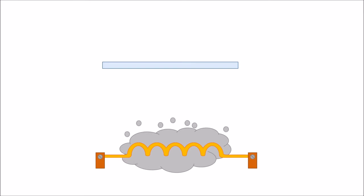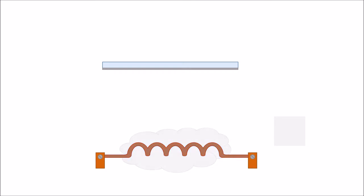The gaseous titanium atoms will make their way through the chamber until they land on a cooler surface, where they will solidify and form a film of pure titanium. Pure titanium is very reactive, so if an oxygen or nitrogen molecule touches the film, it will react to form titanium oxide or titanium nitride. By reacting the air molecules into solids, the total amount of gas in the chamber decreases, meaning a lower vacuum is reached. Eventually, all the titanium will have reacted, and the TSP will need to be heated again to create a new layer and start the process over.